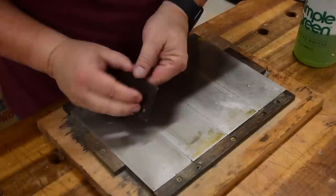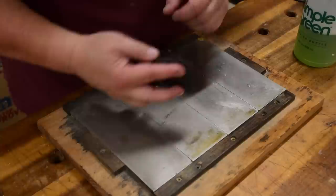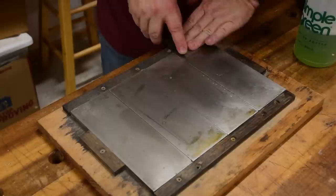When putting pressure down, see where the bevel is — my fingers are on top and most of the pressure is going on that back bevel. I'm just moving forward until I can kind of feel it every now and then kissing. As I'm doing these strokes, probably only two out of three I'm actually touching the very top of the blade — that's just how I maintain it somewhat flat so I don't round it over. I've got a small burr all the way across, so I just remove the burr.